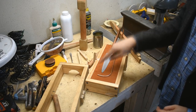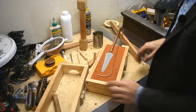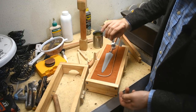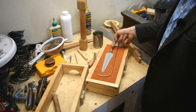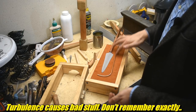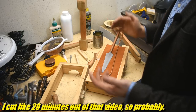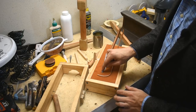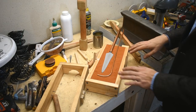This is what I'm hoping to do as an in-gate and kind of a feeder — big thick copper pipe. Now you might look at this really thin piece and think it's too small, or that it's not connected. Don't worry about it — I'm going to cut it a little bit bigger later. It's small for a few reasons. I want it to kind of choke the speed. I don't want to dump the metal in and just fill it up because you get turbulence and junk. I want this to act as a choke. I don't want the metal just gushing in — I want it to flow in, kind of get trapped, and then gargle up through this, filling up the feeder which will be very tall, adding head pressure to hopefully fill in some details. That's why it's small.